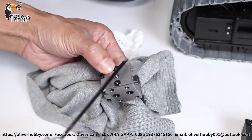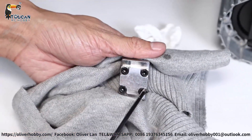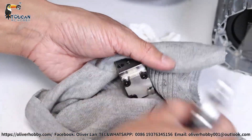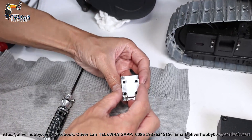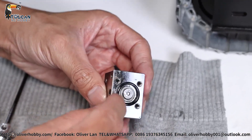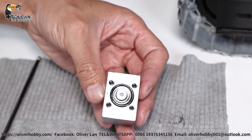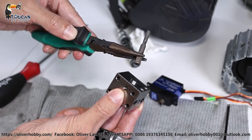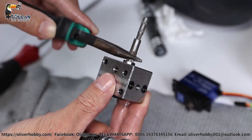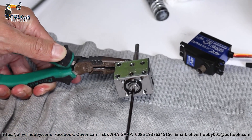Now I will open to see inside the valve. The top has in and out ports and the servo shaft connection. Four screws removed and already loosened — then we can open the cover. Turn it around, four screws removed, pull out. That's the cover seal. In the middle is the curved piston. One more step to remove it — one more screw here. To stop the piston inside from turning freely, use the iron key and then unscrew this screw. So then I can see the inside piston shape.